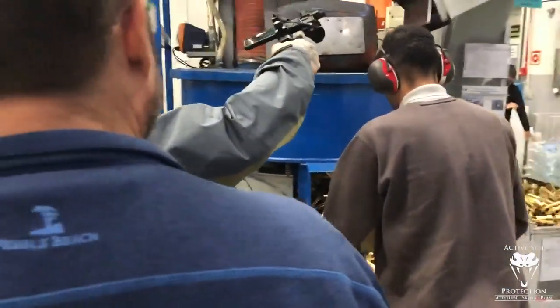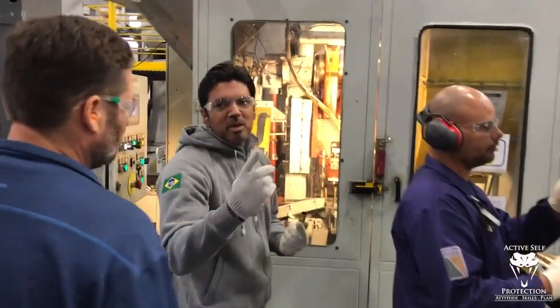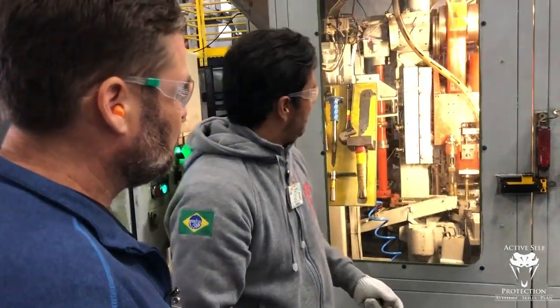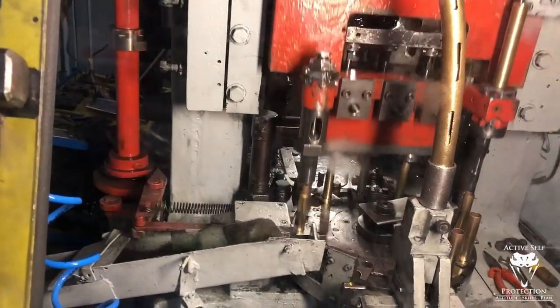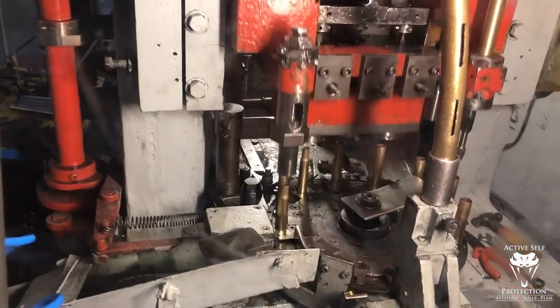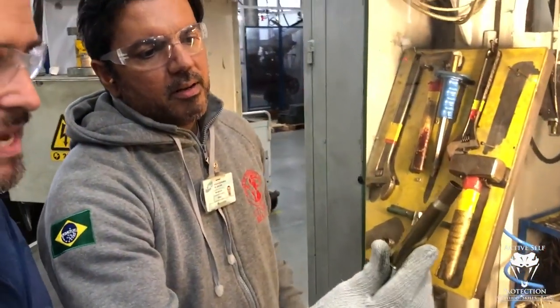But we can see tapering. And then you must remember to change, because I will show you that machine running now. I show you tapering. The material that is an inlet is ready to be tapered into the shape of a 0.50 ammunition. Is that tapering it in one press or two? Just one press. Then we have the case taper.